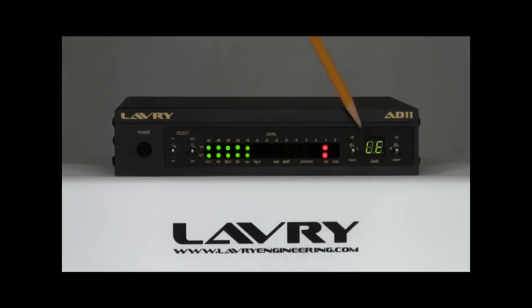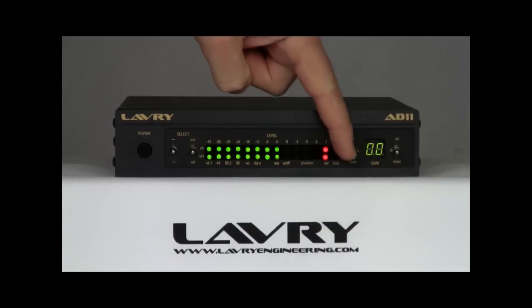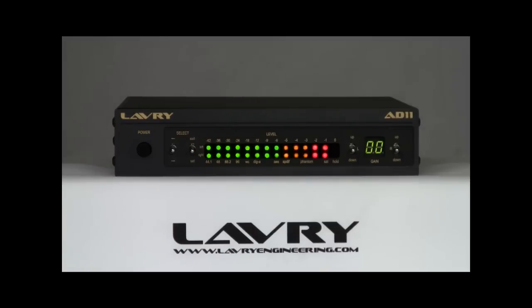The front panel features large LED digital level meters and a numeric gain display with separate controls for left and right channels. Because the numeric display is common to both channels, it displays LE until a gain control is actuated, then switches to showing the gain setting for that channel without changing the setting. To see the other channel settings, you just click the gain control for that channel.